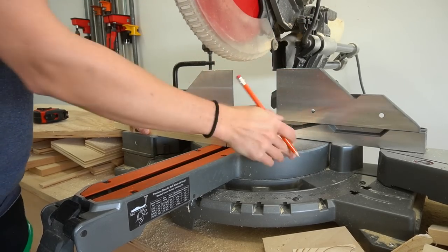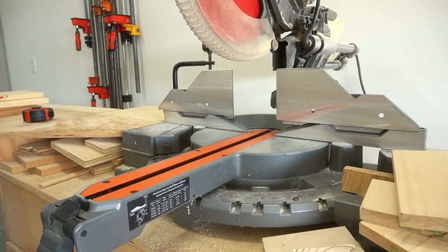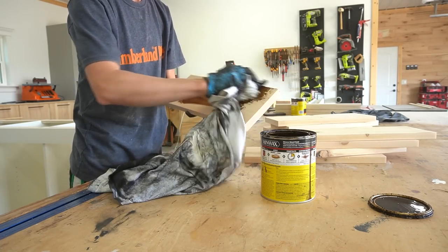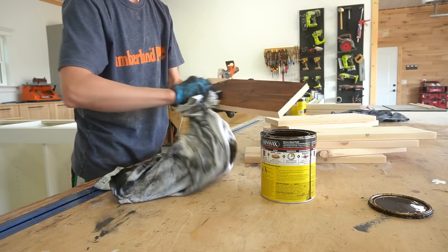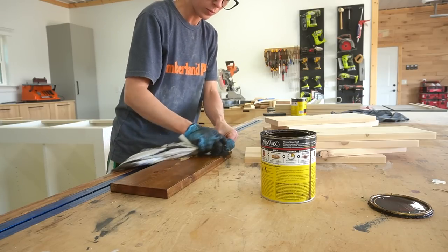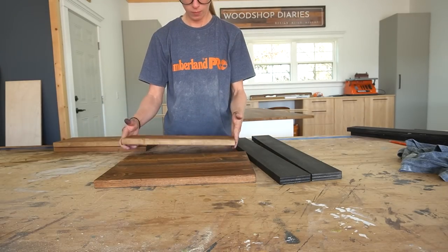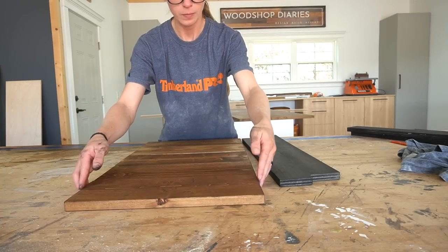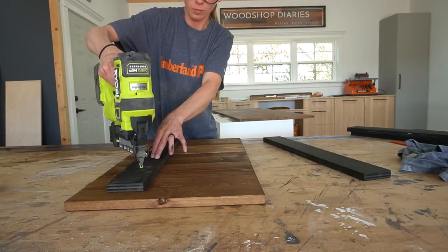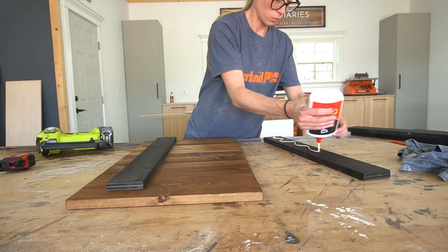The final part — the part that made the biggest impact — was the doors. You can certainly make any style door that you'd like for this, but I chose to make solid wood slatted doors. I cut down five 1x6 pieces for each door, plus two thinner slats to run along the back side. I cut my back pieces from scrap plywood, but 1x3s would work as well. I went ahead and stained these pieces before assembling — the color is Minwax Provincial. I stained the back pieces in Minwax True Black, but these are hidden so it doesn't really matter. I laid out my 1x6s face down and glued and nailed the back pieces on to hold it all together.